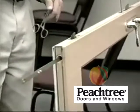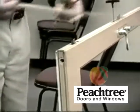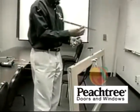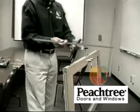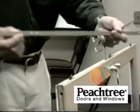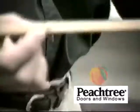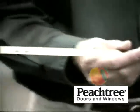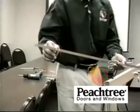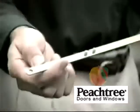So this is a drive bar, the bottom drive bar, and you have to push down the bolt to bypass the small axle or pin in the middle, which prevents rattling of the bar inside the panel. Now you'll note the bottom drive bar is marked with a B on the end, and on swing panels you have 2 sets of plastic rollers, 2 pairs of plastic rollers. On a sliding panel, it's a similar bar, but the rollers are towards the middle, and spread apart a little bit more. Okay? Swing panel, bottom bar marked with a B.